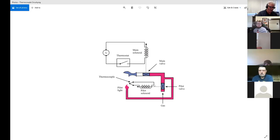Now, somebody said the valve was stuck. Well, no, because if the valve was stuck, you wouldn't be able to push it in manually and get this thing to light. The problem is when you let go of it, it's not staying in. So basically, the problem has to be right in here in this electric circuit, with the addition that the flame has to affect that. Questions?